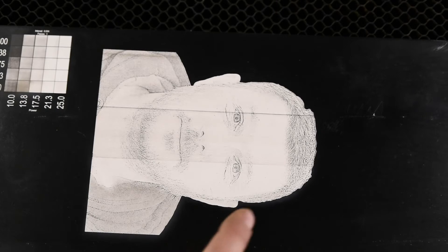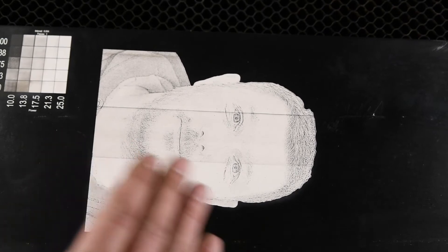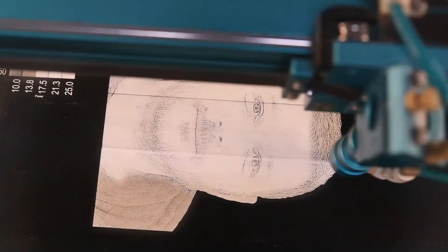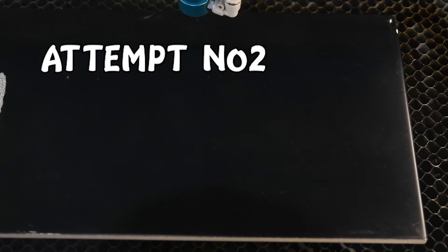That just finished. In the middle I'm thinking that when I sprayed it, I sprayed the middle more than the edges, so I've got this line. Nothing moved from before, so I'm just going to send the job from that point. This time I'll put it on the upper end of the tile just to see if it's the paint. I flipped the design round to see if I still get those lines going through it. I've lowered to 200 speed and 20 power — from the material test, that's what my letters were and they came out nice. So 200 speed, 20 power, framed in there ready to go.